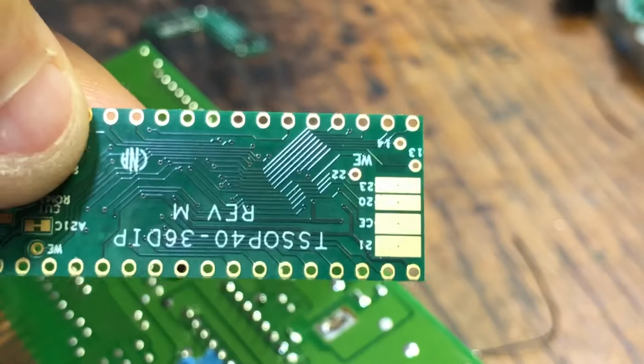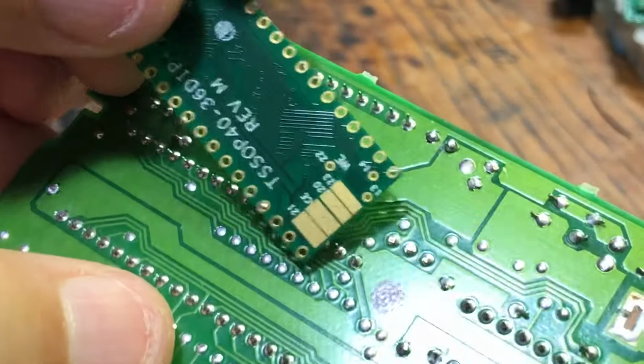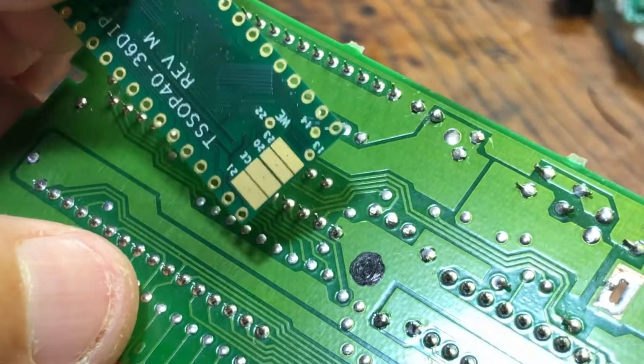because it has exposed copper on both sides. You notice that on this cart, we've got all these solder vias that have solder balls on them, especially here. Well, right here. These are the ones that would get exposed the most. And in fact, if you were to put this mask ROM adapter directly on top, just lay it down flat, then it would definitely short out with some of these pads on the bottom. So first thing we're going to do is put a little bit of Kapton tape on this, and I've already cut a piece.